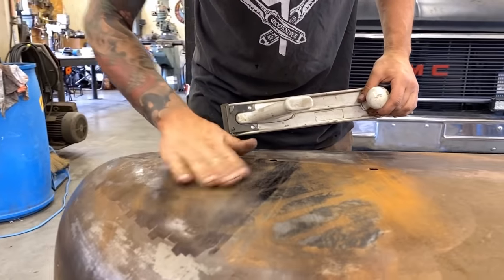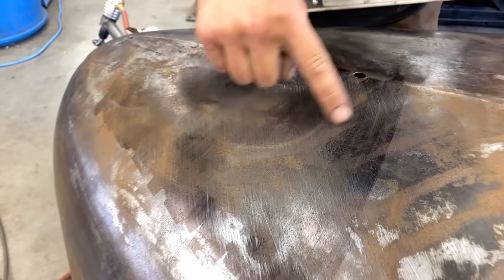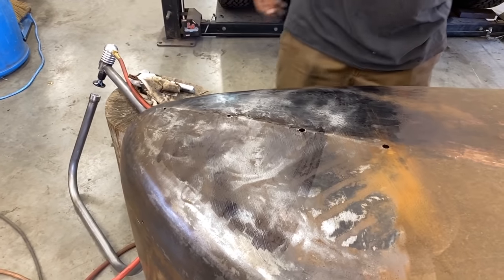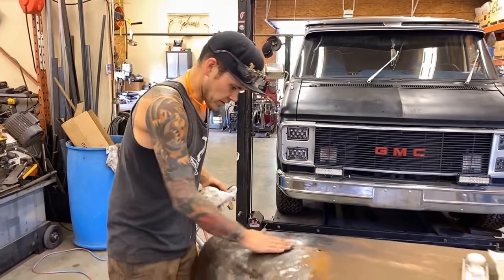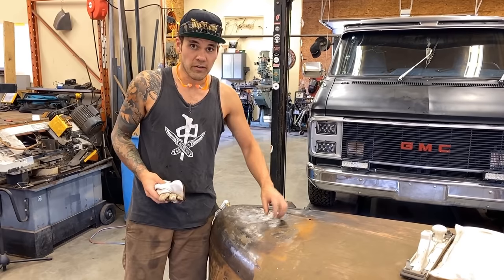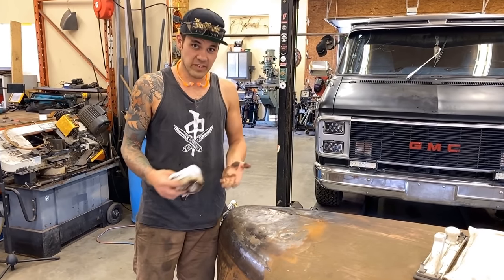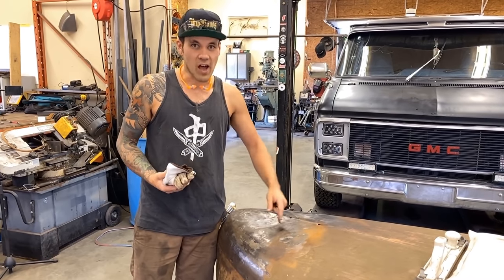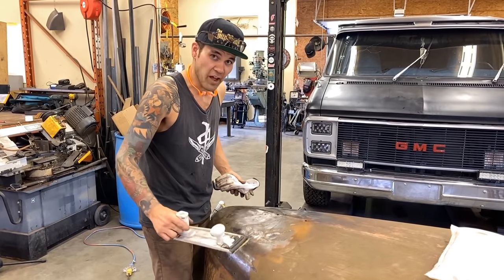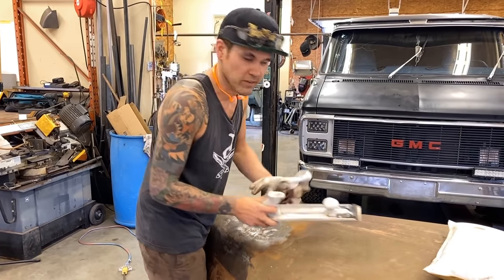You can see here it's quite good — it's showing a little bit of a low, not even so much a low as rougher material. We've got a bit of a low here, a little bit of a low here, and this is our high. We're going to go back to the shrinking disc for another round. Another thing that using the sandpaper does is it takes off this marker — the marker itself will actually act as a little bit of a barrier between the shrinking disc and the steel. You want steel to touch steel — metal on metal. If there's marker or dye on there it's going to make it harder to heat up. So the sandpaper is dual purpose: it shows you the highs and it also takes off the ink on the highs so the disc can touch metal on metal and create heat.